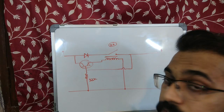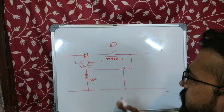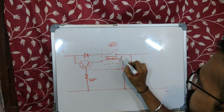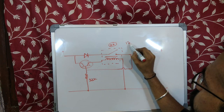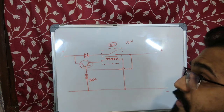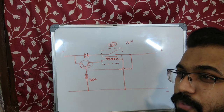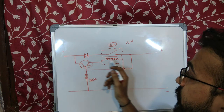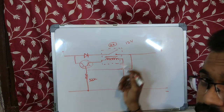This is the circuit that I designed and it's a pretty simple circuit. It has a single relay here — I used a 12V relay. I used a relay because if you use a transistor, there is always a certain part of the current flowing through the circuit. So if I use a relay, it will completely cut it out from the source and destination.